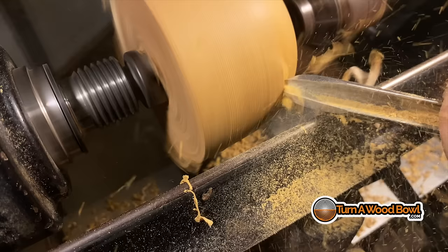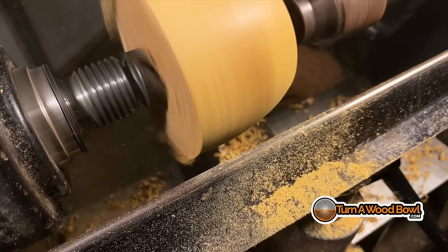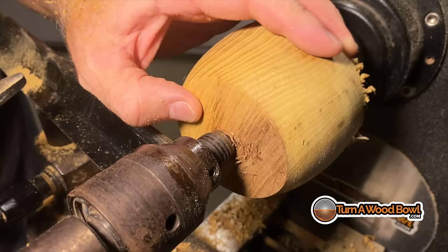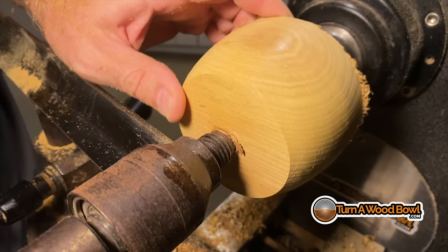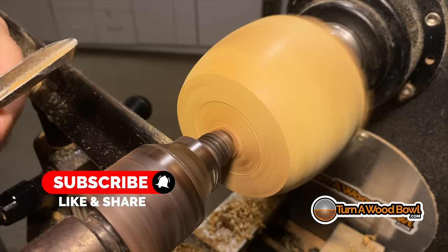If you're interested in getting really good with the bowl gouge — or if you're thinking about using one — check out that course because we go over everything you need to know to master it. Here I'm cleaning up the face. I don't want to make this a very deep cut, just deep enough to smooth off that material. There's a little bit of a low spot so I'm taking off a little more. I'm using my half-inch 55-degree bevel swept-back bowl gouge. Both of these bowl gouges have the same bevel profile — that's just what I prefer. I'm going to mark the tenon, then clear away some material to create the tenon and the shoulder.